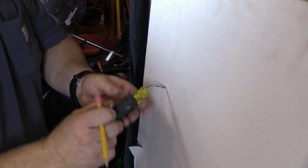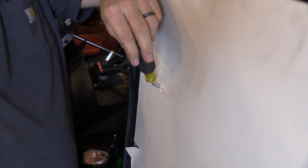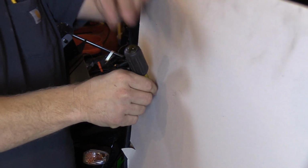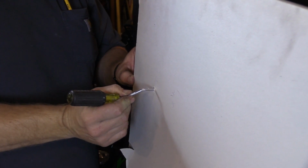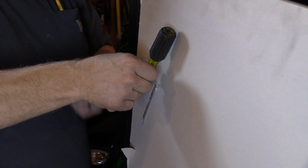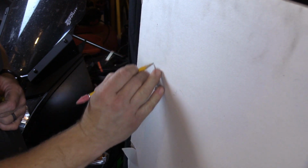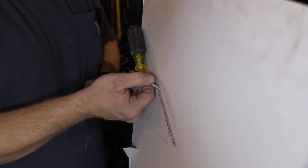So watch. You'll do it, and you'll spin it, and you'll spin it, and you'll stop. Same principle. You know where it is, you'll pull it straight out, and you'll just put it straight down where it was, just like so. So you know now, you connect these two dots, and that's where your stud is. And you know that all of this area right here, this whole circle, because you spun your screwdriver all the way around, is completely free. Pretty cut and dry, right?